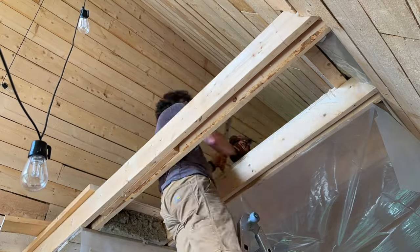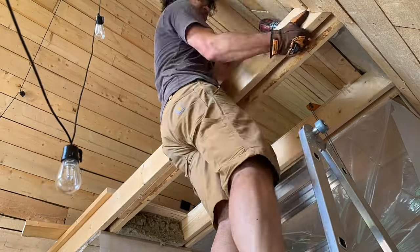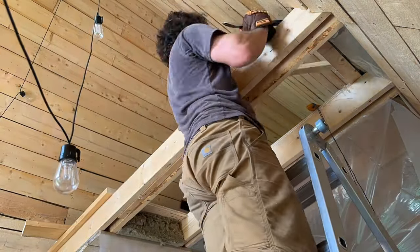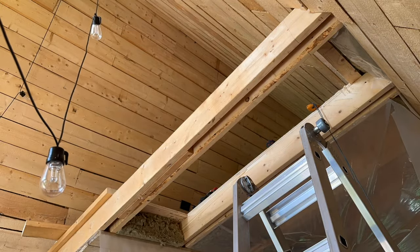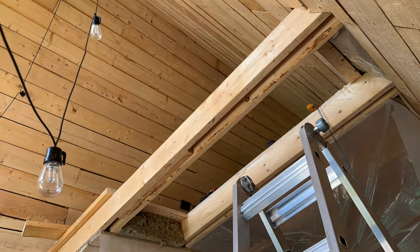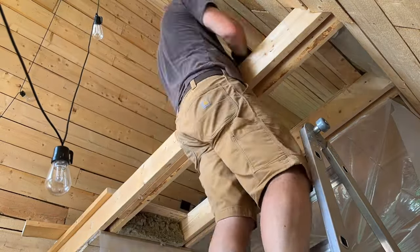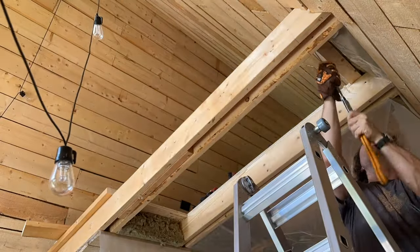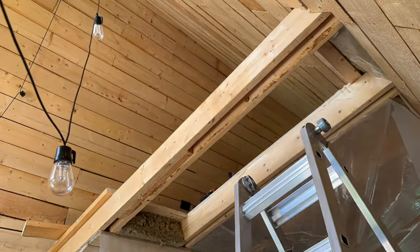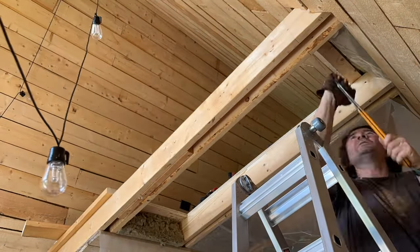You can see here I'm using every saw I've got with me to cut this opening. So if you're planning on building an A-frame or any structure that has a loft or an attic, and you want to install a folding attic ladder, which I do strongly recommend, you definitely want to make sure that the opening is planned from the beginning, and that will save you a good 2 or 3 hours of pain, which you're witnessing right here.